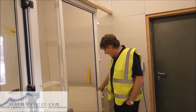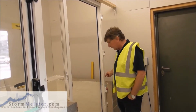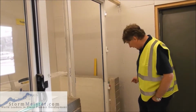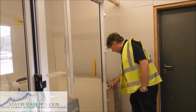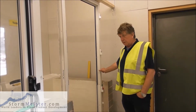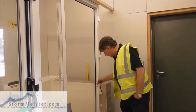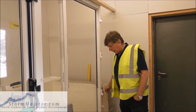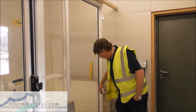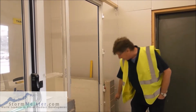We've sealed round the neck of the fixing screw so that water can't come out if water does happen to get into the frame. What we're going to do now, we're going to pull the packers that we've used here. We're going to pull these out because they've done their job now. We pulled them out, the frame isn't going to move. The reason we're pulling them out, if we can get them out, is we're now going to, after we've done that, pump sealant in the gap between the wall and the door frame. Okay, we've already got plenty around the bottom.